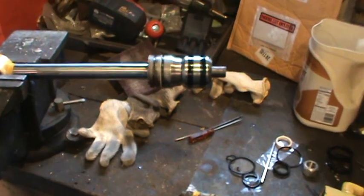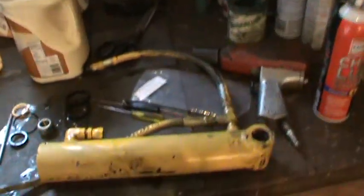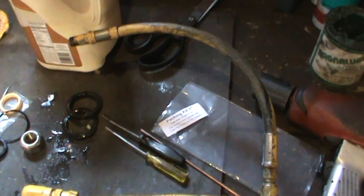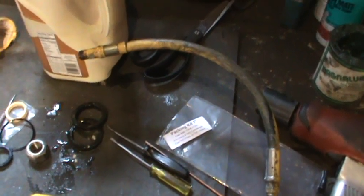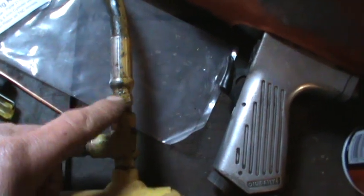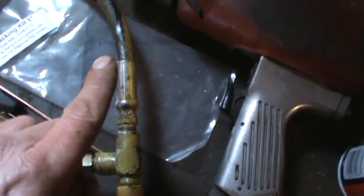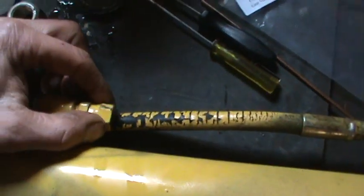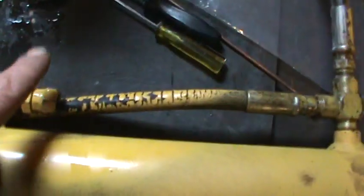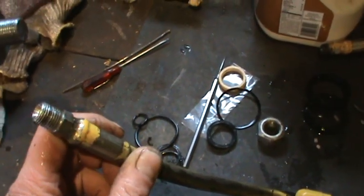It's already apart and in its segments. This is the body of the cylinder as you would take it out. The other line you see there — one goes to the other cylinder on the other side. The connectors on them: if you look at this one right here, it just threads in with no way of taking it out without the whole line being able to spin. So you've got to look for connectors that have a collar — the collar spins and that's where you're able to take them apart. That's why you see the line removed from there. Up by the control box is another line like that, so the lines stay on.